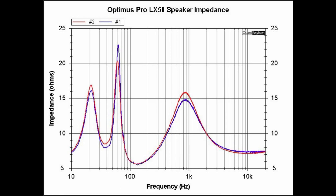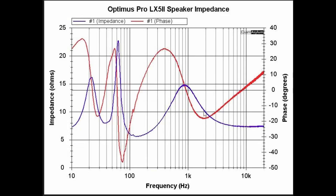In case you're curious about the phase, here's the phase plot in red alongside the real impedance we just looked at. You can see how the phase varies over frequency — it basically goes from about 0 to maybe 23 degrees worst-case phase change.